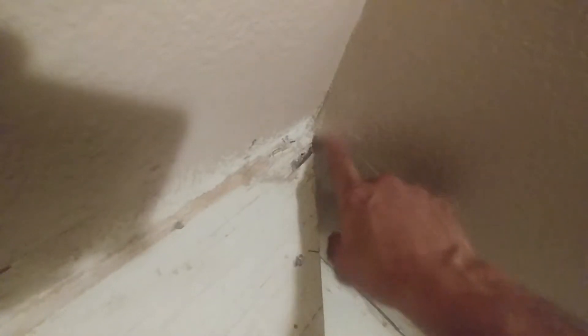There was a gap down here. My biggest mistake here on the stairs — you can still see there's a gap in there. I did fill and mud the sand, but it was so hard to sand because of the step here — I couldn't sand it. So what I'm going to do is I've got my new baseboard cut that I'm going to go here and actually go up. It's going to go right to here and I'm going to caulk that in. There's going to be a bit of a gap because of how that wall sticks out a little bit. I've got that baseboard cut.